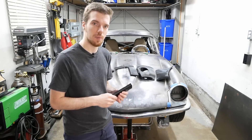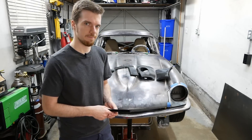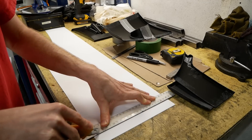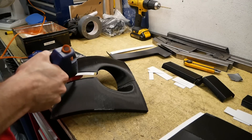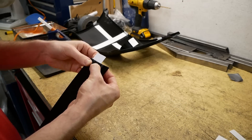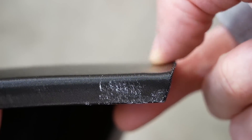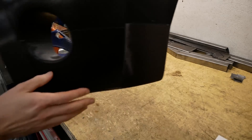That's all the parts for the driver's side bumper. As remember, we're going to be building the front in three sections, so there'll be a mirrored set of these, and the lip will come later. I tried using the handyman's secret weapon to temporarily secure all these parts, but it failed after one day and left sticky residue everywhere. So instead we're going to try some strips of plastic and hot glue. The PLA filament we're using will start to deform at only 60 degrees C, so we don't want to overdo anything and warp the parts. We've got a bit of that right off the printer anyway — I was hoping a solid thickness with no infill would be adequate, but partly due to print orientation, partly due to heat, and mostly due to my naivety, we haven't lucked out. So I guess these will just be prototype parts after all.